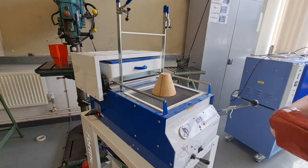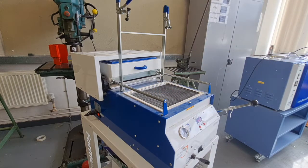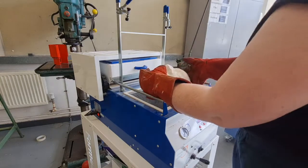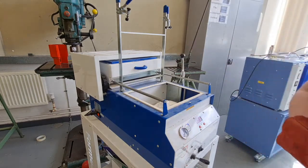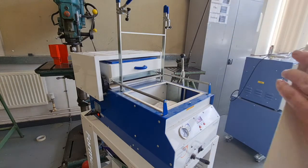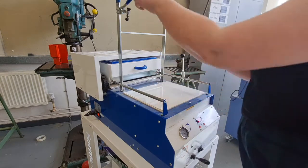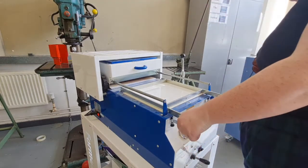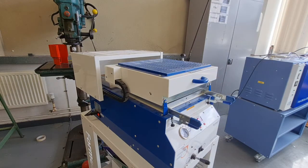We have a few different things you can use for moulds. Not for this project, but a really fun one we have is a mask — this guy here. We're lowering the mould down into the bed, getting our bit of HIPS. Make sure there's no coating on it. Place it in, bring the handles down, make sure you're getting a proper seal on there and clamp it in place. Pull the heating element across and let it all heat up — takes about a minute to heat.